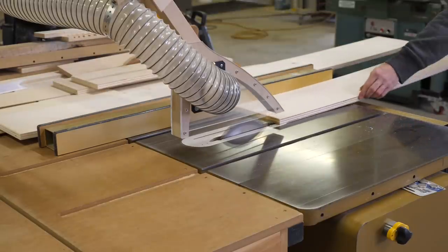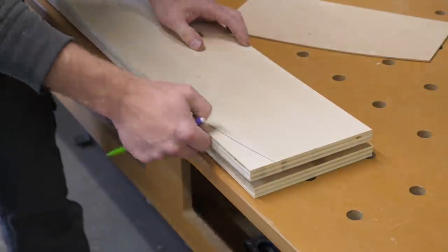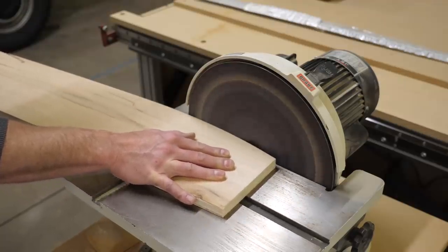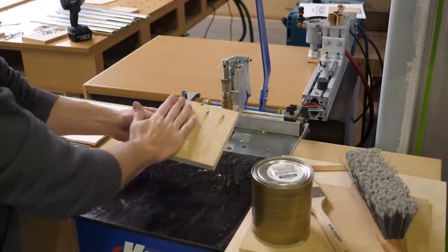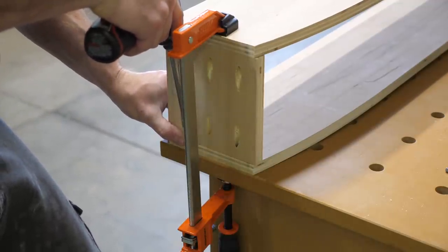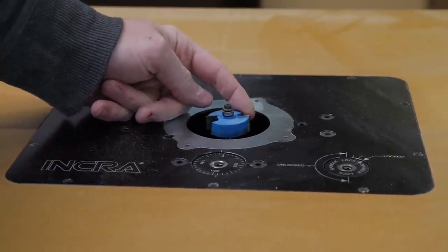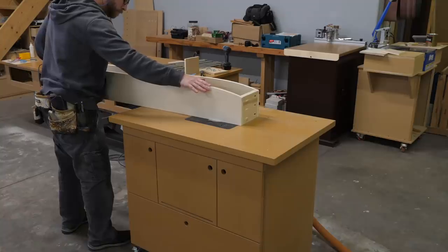Off to finishing and on to the third and final project. I'm calling this a headboard — it's a long narrow cabinet that takes up the space between the bed platform and the rear doors. This would be a nice place to set a book or a bottle of water and would also prevent a pillow from falling off the end of the bed. This is a tricky space and I needed to either notch or curve the cabinet to create clearance for the rear doors to close. I decided to go the curved route. I use glue and pocket holes at the two ends, match the curve of the top and bottom to the sides with my trusty block plane, then mount a rebate cutter into the router table — this rabbet will house the back.